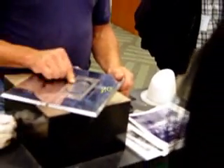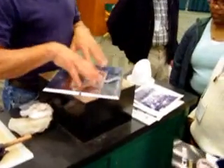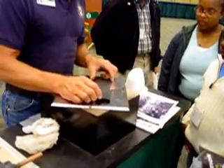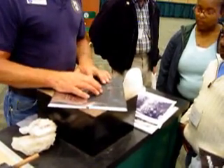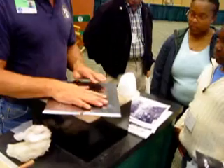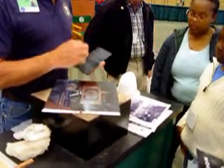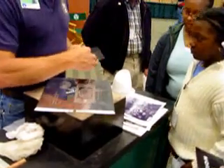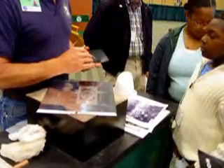The way that they got that image on there is they take a piece of plastic off the original hundred-and-some-year-old image. They take a special piece of plastic, stick it over top of it, and heat it up. This side liquefies and drops down into the engraving. You peel it up and now you have a right-reading image — see, this is backwards, but you could read it now. It's called a right-reading image.